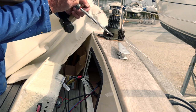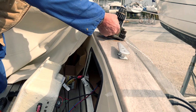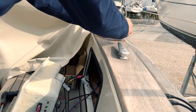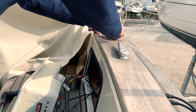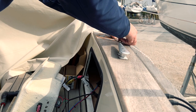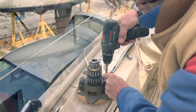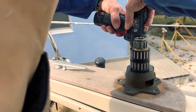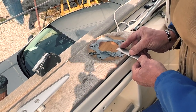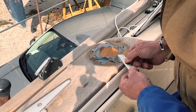It was quite difficult because all the old bolts were full of butyl. You can see here there is a lot of butyl that I used to avoid water penetrating into the substrate, into the teak, into the fiberglass. With the help of a small blade, we removed the excess butyl. After that, we moved to take out the second winch on the port side. We needed to use the drill because the bolt was very covered in butyl, and Andrea removed the excess. I think butyl is fantastic for this type of work — no other product works as well.